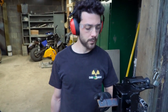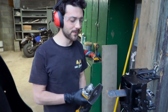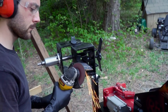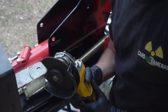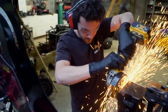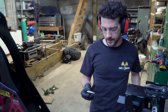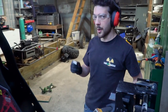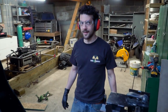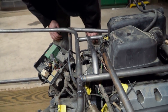We're about to hang the front of the engine and we don't have a vise, so we're using the tubing notcher to hold our flat bar. That's where a bandsaw would be a lifesaver. Like a glove — yeah, it looks good. That'll be for the rear engine mount.